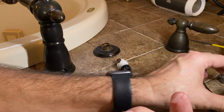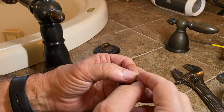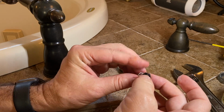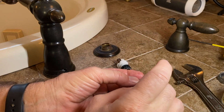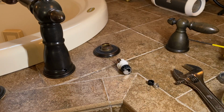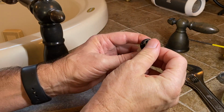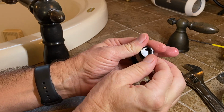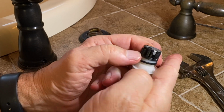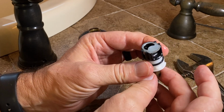Now we're going to come in with some silicone grease. This is the main O-ring, and we're going to lube this up with some, obviously, silicone grease. I've got the silicone grease listed down in the description, and it's pretty important when you're working on faucets. And now we're going to lube up the O-ring, and this is the O-ring that was causing the leak. It was leaking out from underneath the handle. It was just a little bit of water, but it was a little nuisance. So here we go.